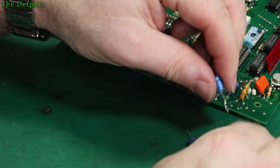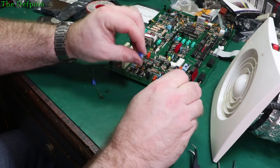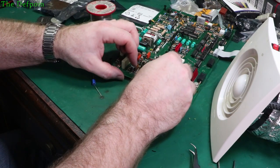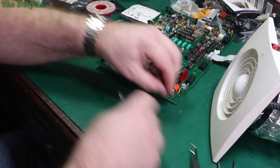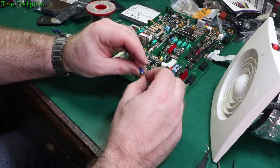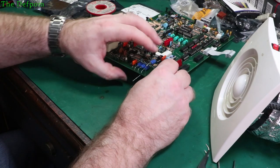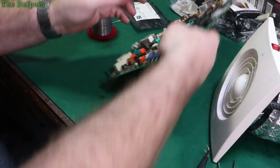They're on there for a reason, I'm guessing. Both of those are out. I'll check those out of circuit in a minute. Here are the new caps - I'll slide the beads on. Try to get them in there so the markings are visible. Always like to try and do that. Always double check the polarity - always. There's nothing like putting an electrolytic capacitor in backwards. That's always an exciting - or troubling - moment because you go, why isn't it working right? What's that smoke? Alright, that's those on there, markings visible. Let's solder those in.